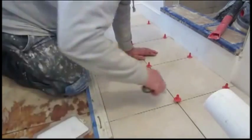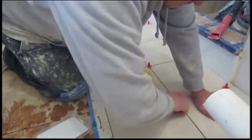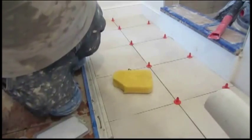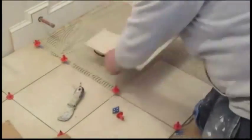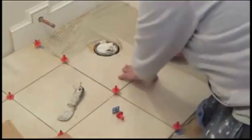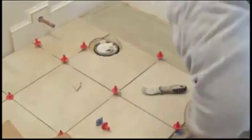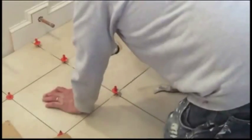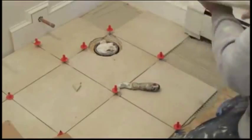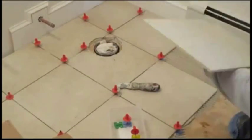That's really all there is to it. You put one of these bases at the bottom, get a few tiles down, then screw them in, screw them down, tighten them up. Once the tile is all done, you just let it set, then you unscrew them to take them out and finish the floor and grout. Just keep setting your tiles with these spacers and sticking your clips in. Once you've got more tiles down, tighten them down and just keep going until you've got the whole floor down.